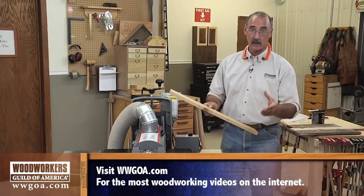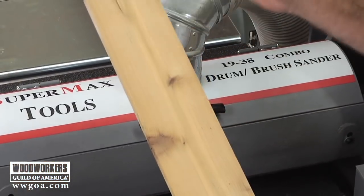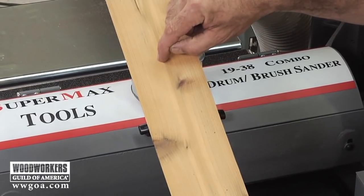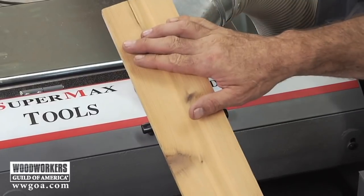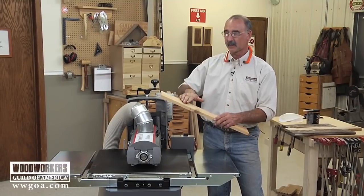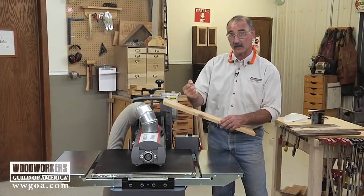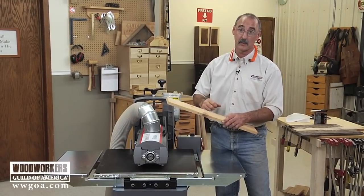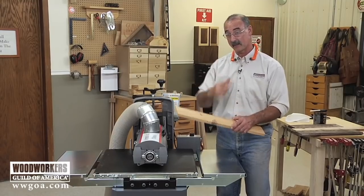Texture difference is what we want to talk about next. All woods have hardwood and softwood in that one piece - I'm not talking about different categories of material, but here in the striping of this material there are parts that are softer than others. So if we run this under the wire wheel, it's a little bit like it's sneaking up on a sandblasting effect. It's going to kind of leave the hard parts alone. Those bristles are going to reach down into the softer parts and relieve them from the material, leaving us with a pretty cool three-dimensional effect. Let's run this one and have a look at what it looks like on the outfeed side.